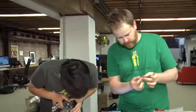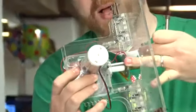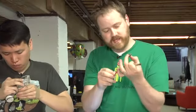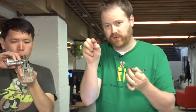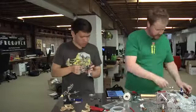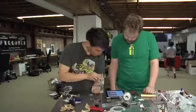The neat thing about this is there's no PTFE tube. On the old one, this big white tube has a tendency to warp and melt under heat because there's a hot brass tube inside. What we're doing is taking that completely out of the equation — we put this red thing inside, and the hole in the red thing is exactly the right size for the filament. So theoretically this should last a lot longer and be a lot less fiddly than the old one.